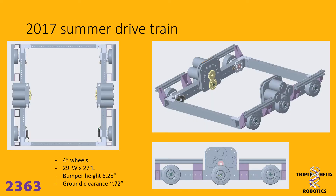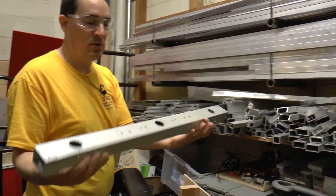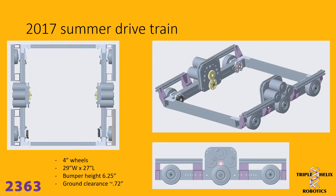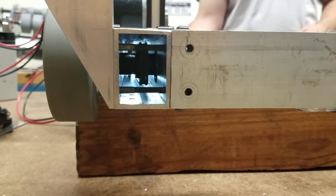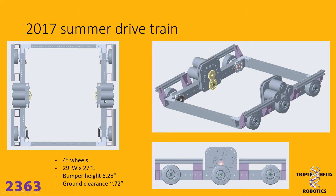In our previous version of the drivetrain, we had these drive rails on either side and we used precisely machined bearing bores to locate the axles for the wheels in locations where, if we put in brand new chains, they were precisely tensioned. These tubes are two inches tall by one and a half inches wide and they fit chains inside of them — two chains side by side. One chain runs along one area to drive one wheel, the other runs along another area to drive the other wheel.